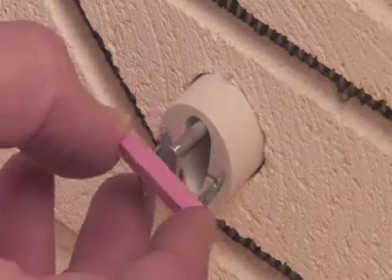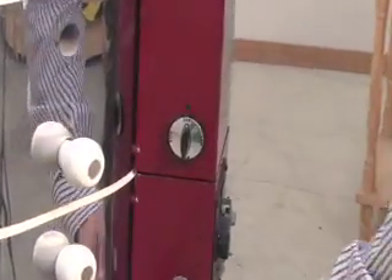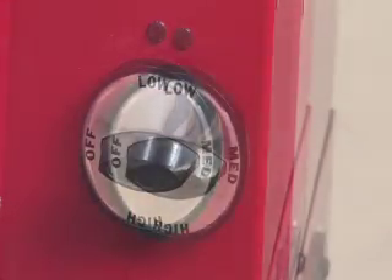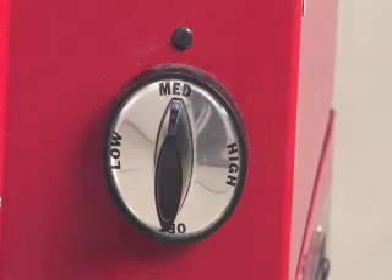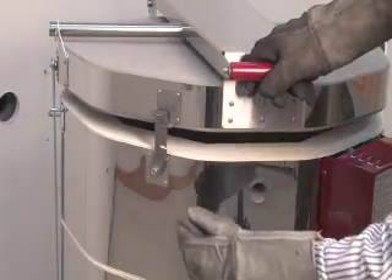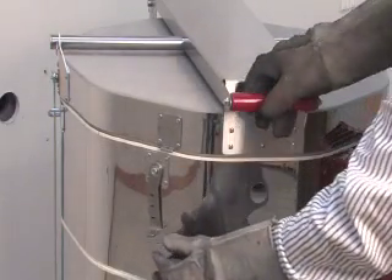You may also use a pyrometric bar in place of a cone. After your kiln setter is set, you will want to turn your switches to low, then to medium two hours later, then two hours later to high. If your kiln was not equipped with a downdraft venting system and you needed to prop your lid, remember to lower it when you turn your switches to high.